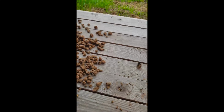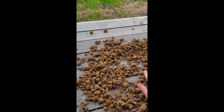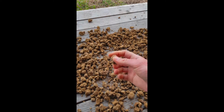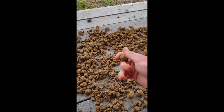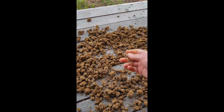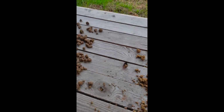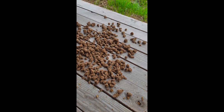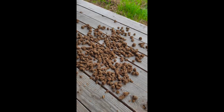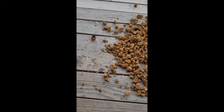very, very good because the point at which I stopped digging on my property is essentially the point at which this yellow clay begins. And so that's a really good sign, indicating that I've removed the expansive clay from beneath where my property will ultimately reside. So I'm going to keep drying this out, and then I'll post a new video once I have the results.